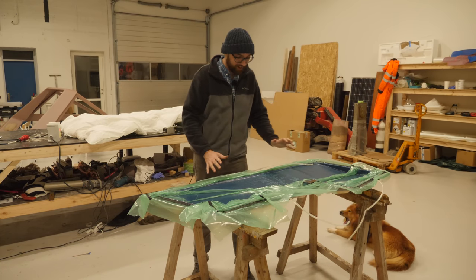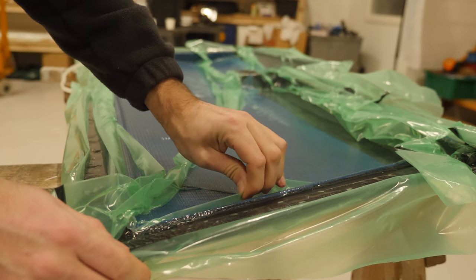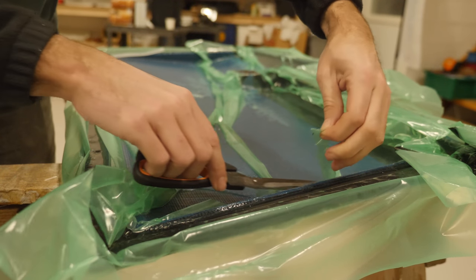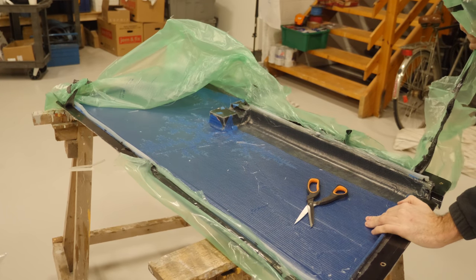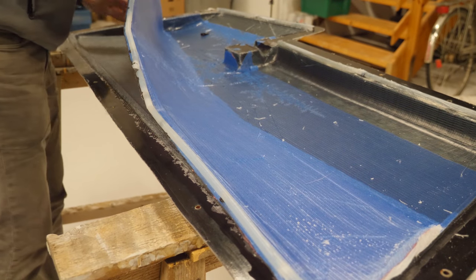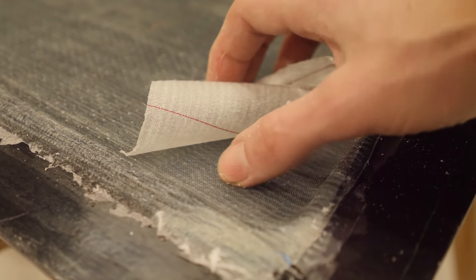And that means we can finally tear into the first half. The vacuum tape is really well on there so let's just cut a hole in this instead. The bag didn't expand quite as expected. The mesh is pretty easy to remove with the release film on there. For now I'll just leave the peel ply on so I don't contaminate the surface.